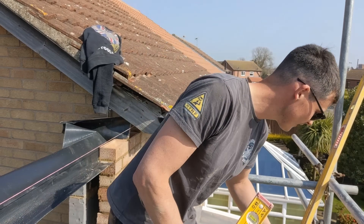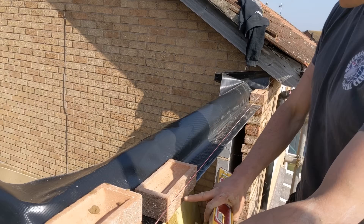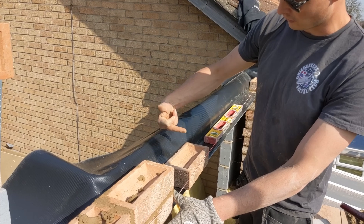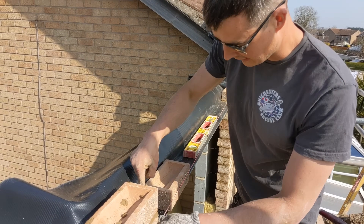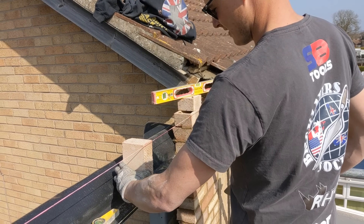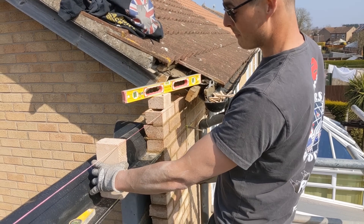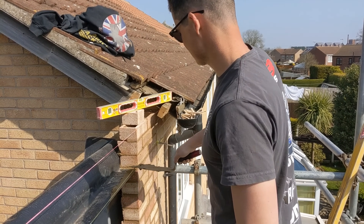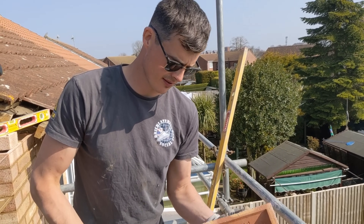Something I want to show you — I've made this mistake a couple of times. You only sit your lintel on, then stick a brick on, and if your line's down there just make sure you've got room on the back of your lintel. Basically, make sure your lintel is not too far forward, because sometimes your brick will hit the back of the lintel. It actually happened down there, so I had to notch 10 mil off the back of each brick when I did my soldiers — a right bother. First of all, just whack your brick there dry to see if you need a big bed or a little bed. At the moment you can see it's pretty much good with the line, so I barely need any compo on that.